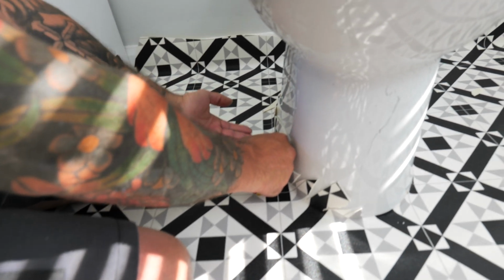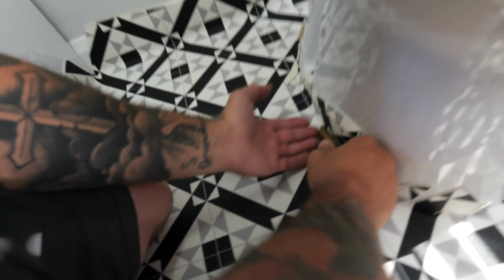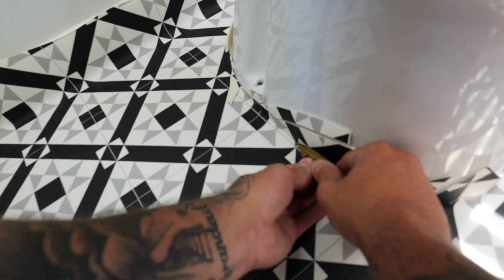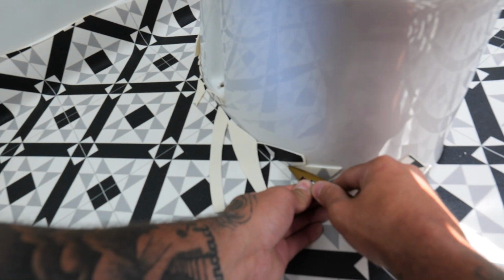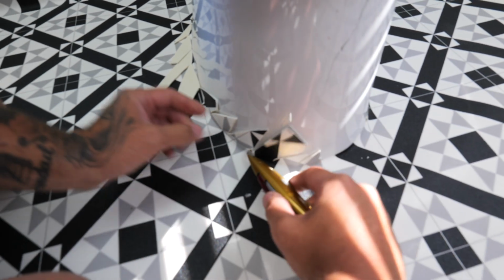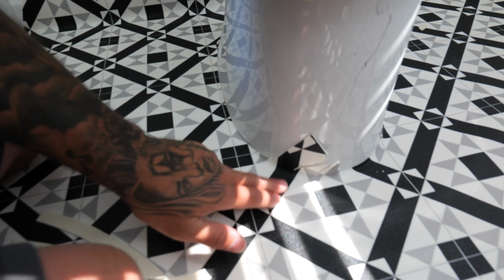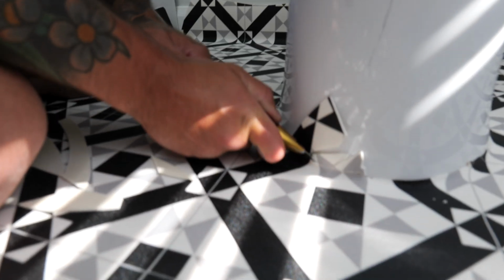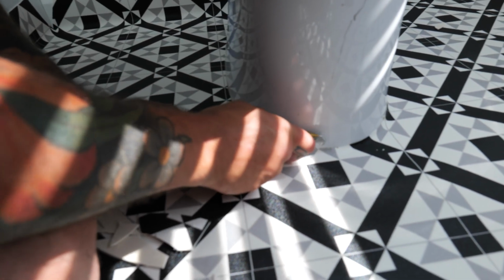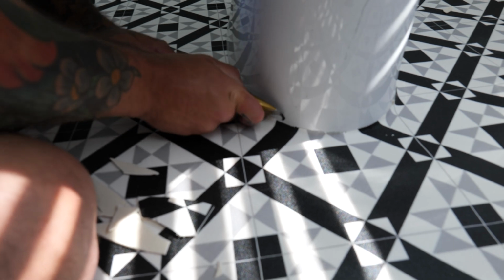doing the same process, 20 to 30-degree angle, and I'm tight against the toilet there, and I'm just pulling it nice and steady, and I'm rotating with the curve. And remember, you can always just stop and start again. So then here I can get my right hand back in, so I'll come back this way. Same process, hook it in, push tight. So we're tight like this against this, about 30 degrees.